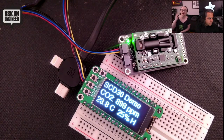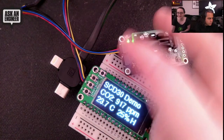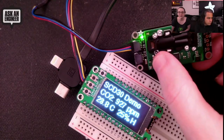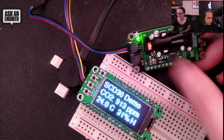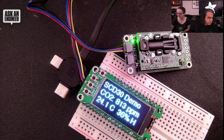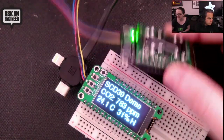The little video we have uses a compressed can of air, which is going to have a lot of CO2 in it. But even just me breathing does increase the CO2 in this area. You can see that glowing IR sensing element at the end — the air flowing in gets measured and then the reading is sent out over I2C.